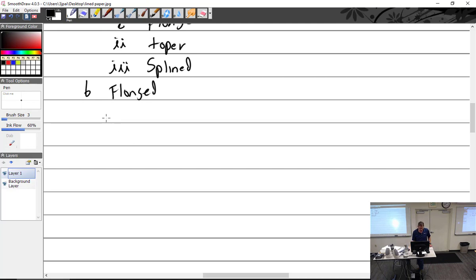I regret that the engine that you're working on, the 290, as they came to us, and they were here when I got here, the bushings that went in the flanges are not the right bushings. It's almost like they picked through a bucket and said, oh, here's some bushings. These bushings should actually be indexed, and they have a certain way they go in, and there are some different ones. These different ones will then indicate sometimes exactly how the prop has to go on. So it is lightly idiot resistant. I don't say idiot proof because they're not idiot proof. They're somewhat idiot resistant. They're there to help you line the propeller up where it should go.